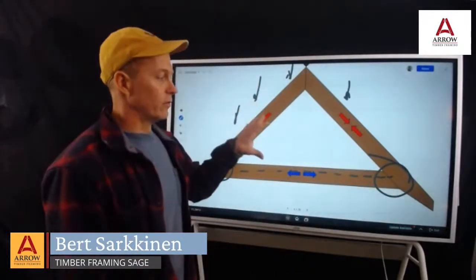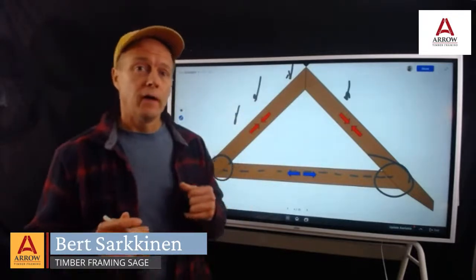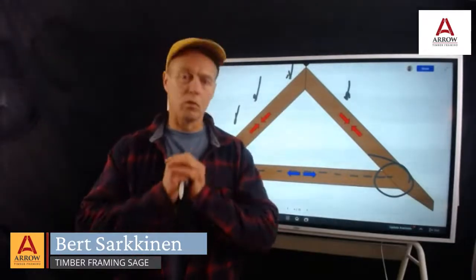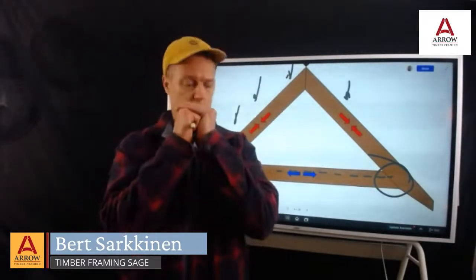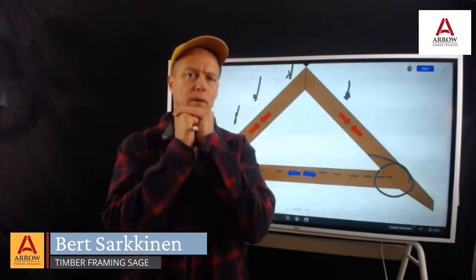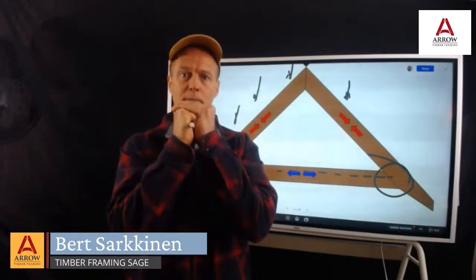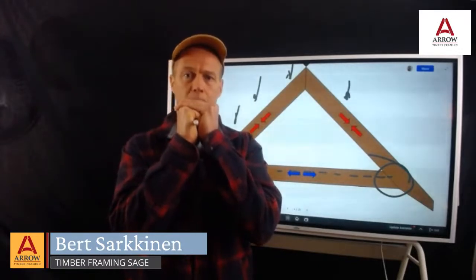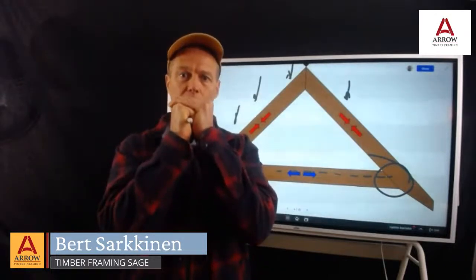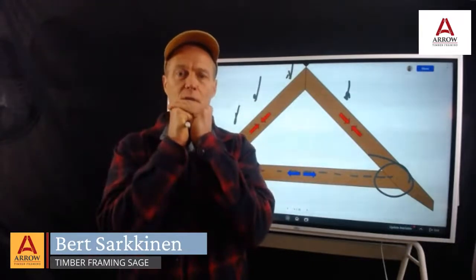This can't fall over. So one thought exercise you can use for yourself, if you were to picture yourself with a coworker or whoever, and put your elbows on a table with a real steep angle. So this would be like a European church or that kind of a pitch roof, and have somebody apply pressure on the tops of your fist and keep going until you start to feel your elbows slide. Okay. And then that would be the thrust or how much pressure you need to withstand.